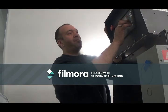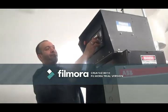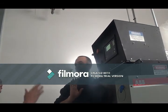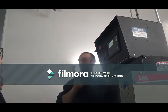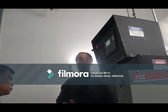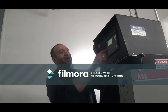Well, one question. If the power goes out, this will start automatically. You don't have to come running up here. And how about when the power comes back? Then it will automatically shut off by itself. That's being controlled by the transfer switch.